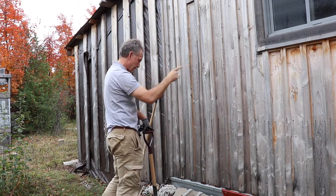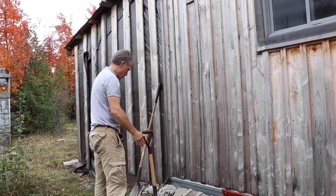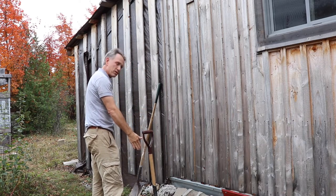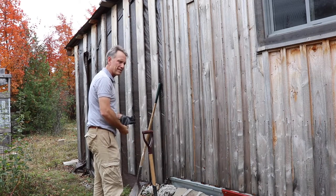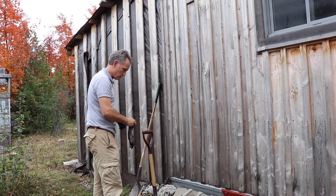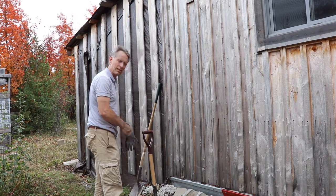I don't know if you can see that. And I've measured out 3 feet here to the edge. So I'm going to remove some of the topsoil here, bring in some gravel, and create a bed where I can set down a couple of patio stones on which the propane tank will sit.